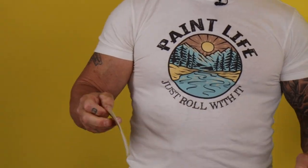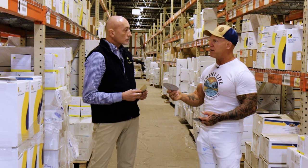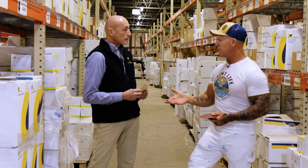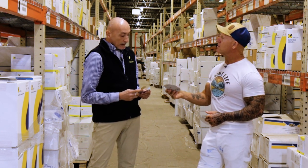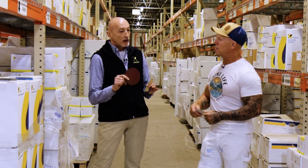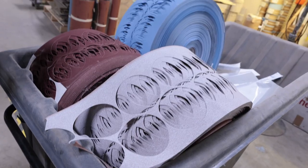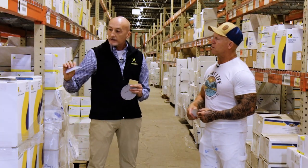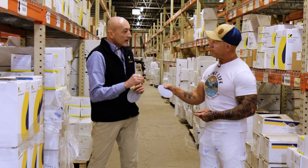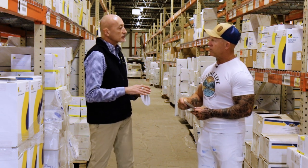How do our viewers know if what they bought from a different manufacturer is cloth, paper, or film? It's probably hard to tell unless the package gives you that information. Cloth you'll always know because it's always going to be kind of a brown color, and it's usually not stearated, whereas these products are. Stearation — which is really easy to see here because it's silicon carbide — you see that white creamy look. That goes back to trying to reduce heat; it's almost like putting a layer of soap on it.